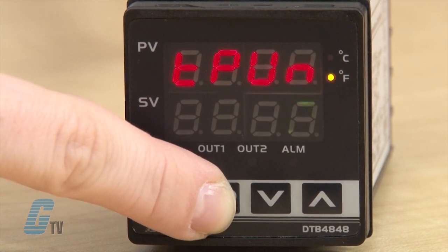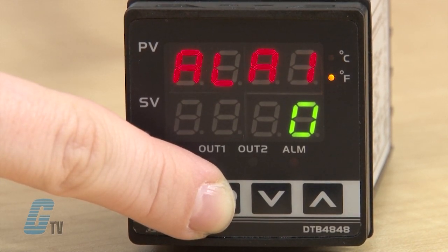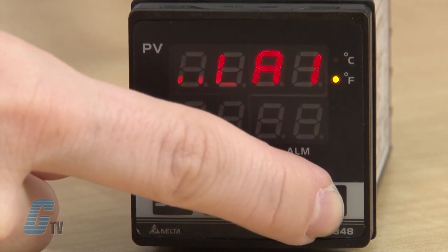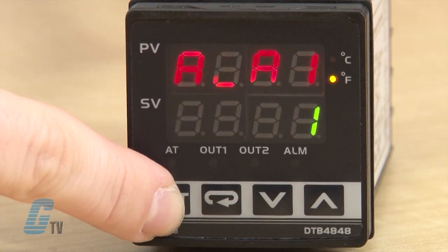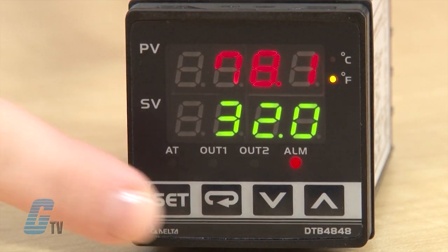To further show the complete list of operational commands, I will need to enable the alarm functions. I will scroll back to alarm 1 and change the value to A1. I will push set to save and then push it again to go back to operation mode.